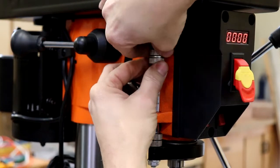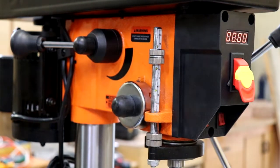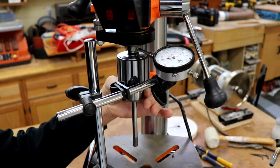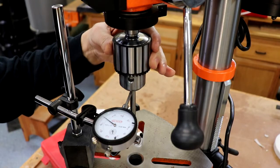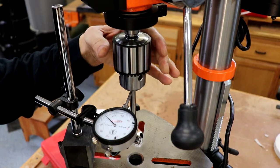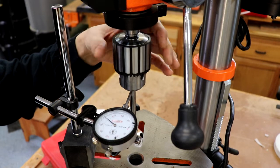There's a very handy mechanism to set depth of plunge for your drilling operations — just set the depth you want, up to three and one-eighth inches, and lock it in. I believe I'll use this feature a lot. I measured runout in a couple of places: at the spindle I found only about 0.001" of runout, which is impressive. Then I chucked up a machined precision steel rod and even on that I only found 0.002", which is really in the sweet spot.